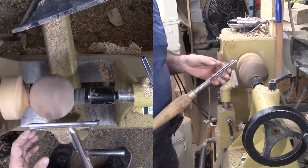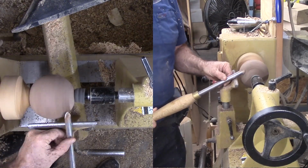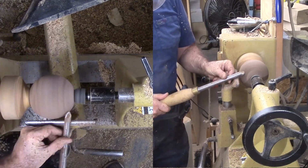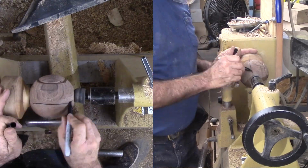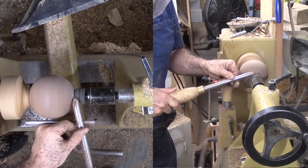This one I have mounted with a cup faceplate and a rubber stopper on my live center. The tenons stick out from the sphere. Now to carefully trim them back. If I had not cut those tenons, I should be able to refine my sphere in 3 mounts. However, with that tenon, it will take more.